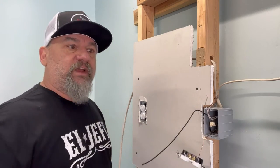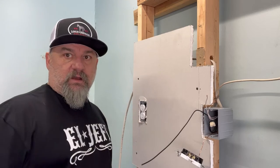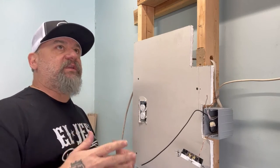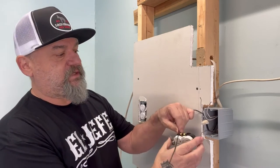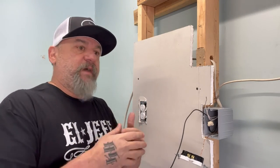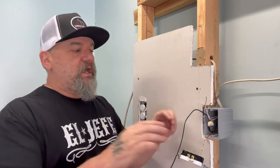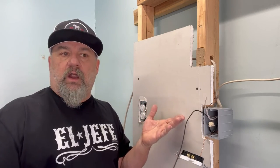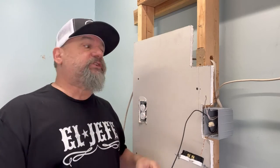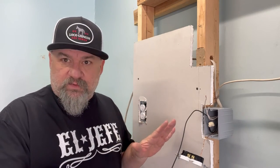So if that light is flickering on that lamp, now it's got to be that plug. This isn't 100% of the time, but this is how we reduce that. If you're in lighting and you see lights flickering — lights flickering is bad. First we check the bulbs. But if something is just dangling next to the terminal or it's a bad connection to the wire nuts, that happens all the time too — that's danger. Take the thing down now. If it's a bad fixture, danger. Flickering is arcing. Arcing's bad — we don't want anything to arc. And if you have kindling, just like a flint rock in the sticks or hay, then there's a problem. Anything flickering, get to it now. It's important.